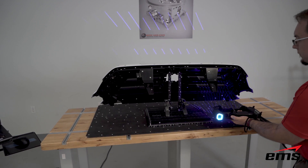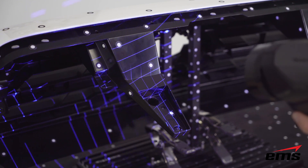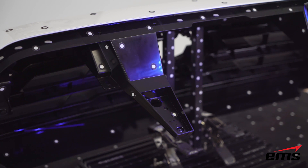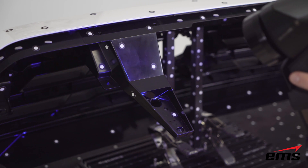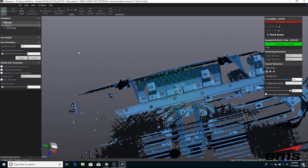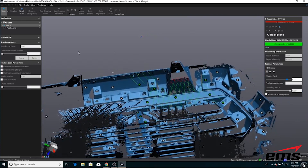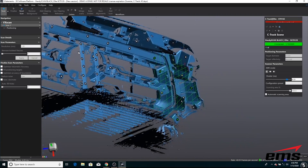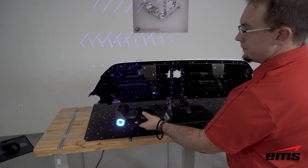When you're doing plastic thin-walled or sheet metal thin-walled parts, it can be very difficult to align two separate data sets because you don't have much overlapping data. By using the targeted table, we avoid that problem. You can see the level of detail on the back of this part — there are lots of holes, tabs, and areas. This is where single line mode works really well to get into those detailed areas. The back side will definitely take some work; scanning the entire part might take 15–25 minutes depending on the detail.